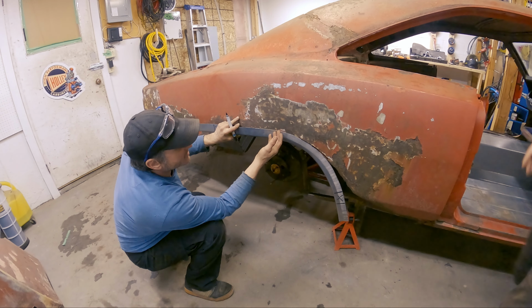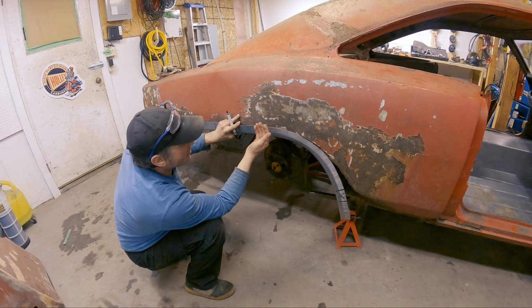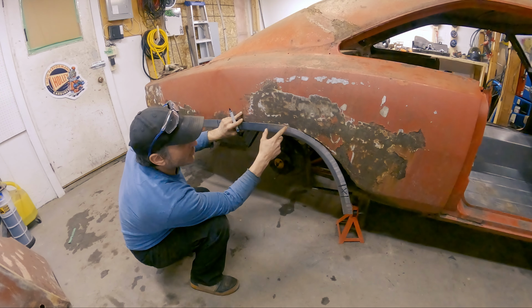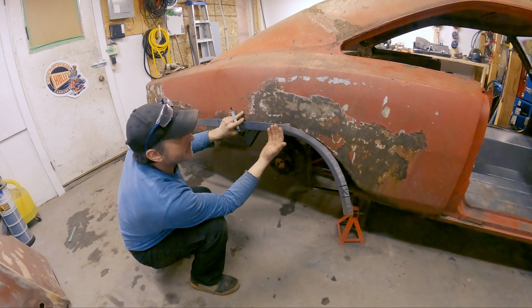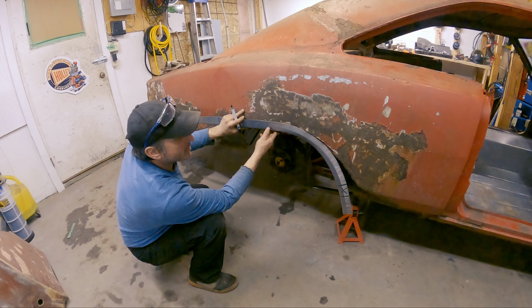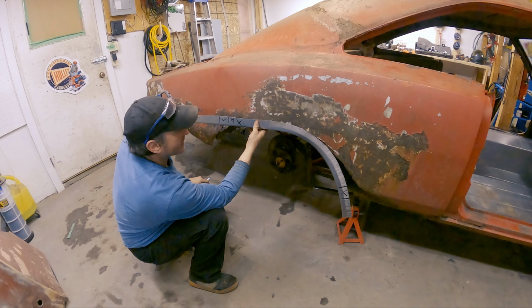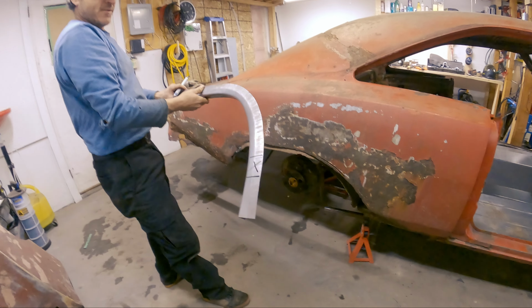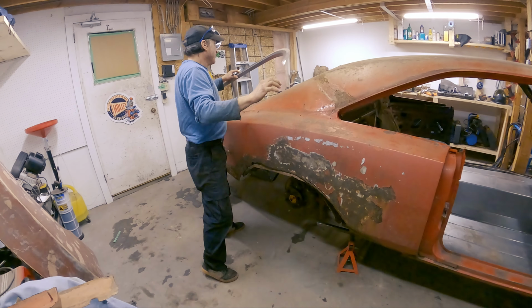Once you start going, you're twisting the metal back and forth. Another trick is if you add a little bit more weld, it will pull that. So you can pull the dents out, like it's a chemistry thing. It's just like welding anything. If something's crooked, you put a weld on the other side and it pulls it straight. Yep.